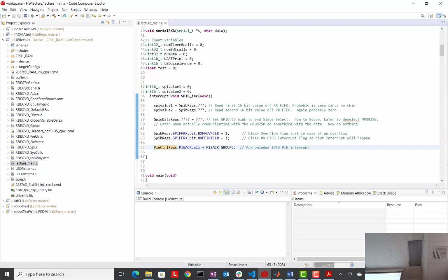We put all those initializations, everything above our enabling of interrupts, is what I'm trying to say. We want to write our initializations such that no interrupts are being used, before we enable them. Because this is only happening once, we really don't care that it takes a little extra time to run these initializations. Remember, using interrupts is the optimal way to do things: other things can be running, and we wait until that interrupt happens, and then we process on that chip. But in main, it's only happening once.